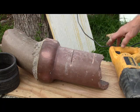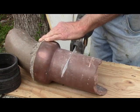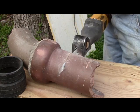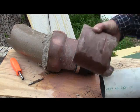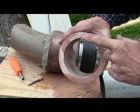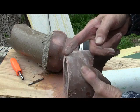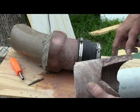Okay, we finally got this thing cut through. You can see how thick these terracotta pipes are — just from the size of my finger up against the wall of it. There are no cracks. I thought for sure we'd get one across the thin part here, but it didn't happen. Normally they don't with these diamond Sawzall blades, so that's what you really want.